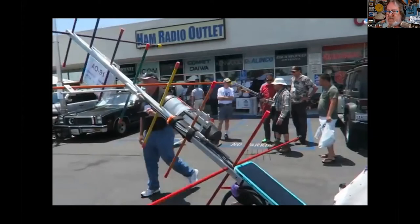When you work these amateur satellites — the low-Earth orbiting FM voice ones — think of them as cross-band repeaters in the sky. It is best if you work them in true full duplex mode, meaning when you key the mic, you can hear your downlink from the satellite. Only one recently available radio actually did that well in both UHF-VHF and VHF-UHF modes — that was the Kenwood TH-D72, but it's no longer in production.